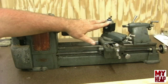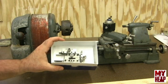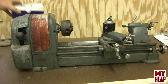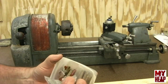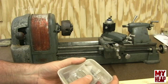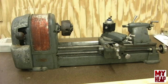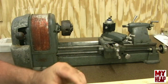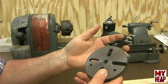Accessories I bought for you: I've got a quick change tool post with four holders — that'll go along with it. Also got a selection of quarter-inch brazed carbide bits; you can resharpen those if you've got a green wheel, and I'll send those along. I have a face plate, and I do have one small dog that's a little tight but I think it would drive — it's too small to use on my Atlas anyway, so you can have it.